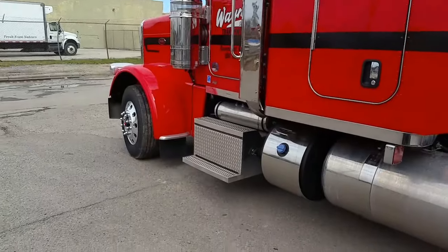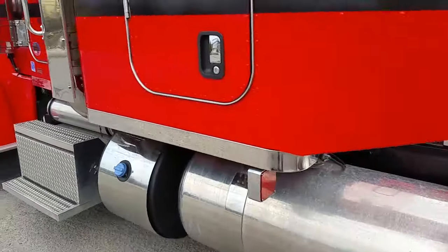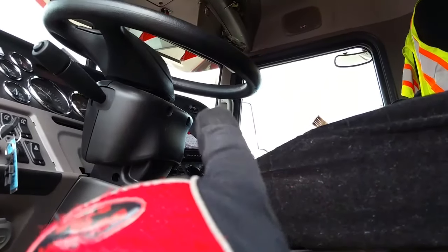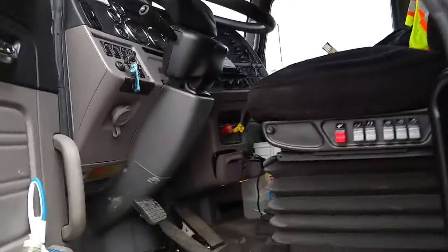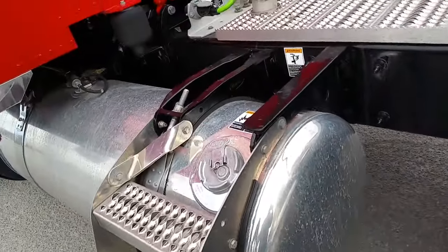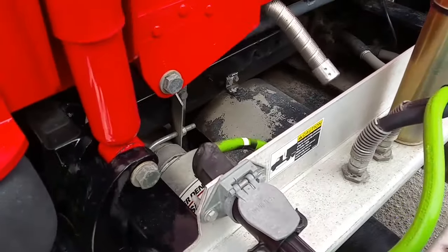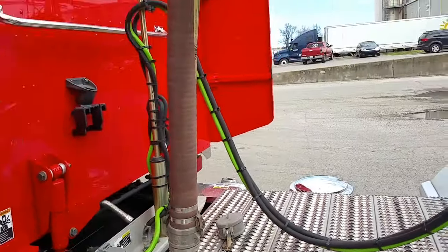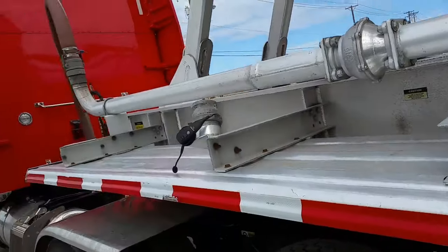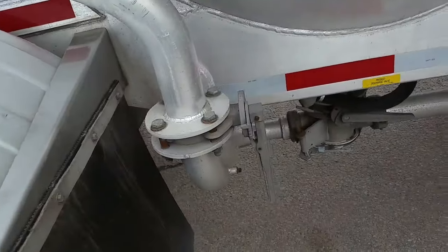Basically, the air just stirs up in there and it blows out the hole. Okay, this here is the whole rig. On the dash, what we'll do is engage the clutch, and then up on the dash there's a button that engages the PTO. Then we take the cruise button up on the dash and idle it up to about 1,000 RPM, between 900 and 1,000. That engages the PTO, which pumps the air up through here, and then the air goes into — this is called the product line — once you get past this valve.